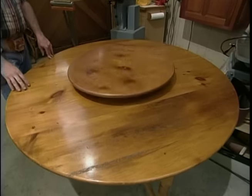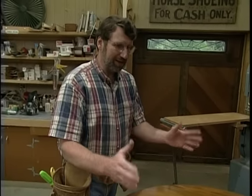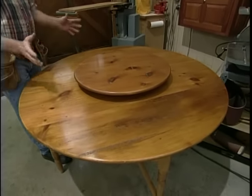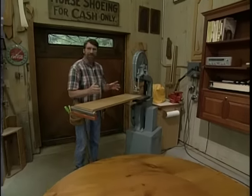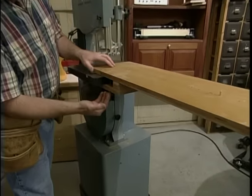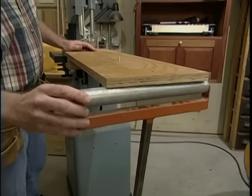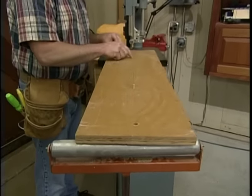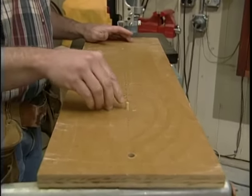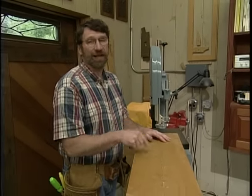Several years ago I built this carousel table — a nice spinning carousel in the middle and plenty of room around the edge for place settings. Now you might think it's difficult to cut these nice circles for the top, that you have to lay it out and use a jigsaw to cut it freehand and try to sand it so it looks round. Well, there's a way to get perfectly round tops easily using a circle cutting jig on your bandsaw. This is the original jig made out of some three-quarter inch plywood, held together with some screws that squeeze it onto the bandsaw table, supported on the far end by a woodworker's rolling support. As I've found with jigs, over the years there's always improvements that can be made, so I think it's time to make a new circle cutting jig.